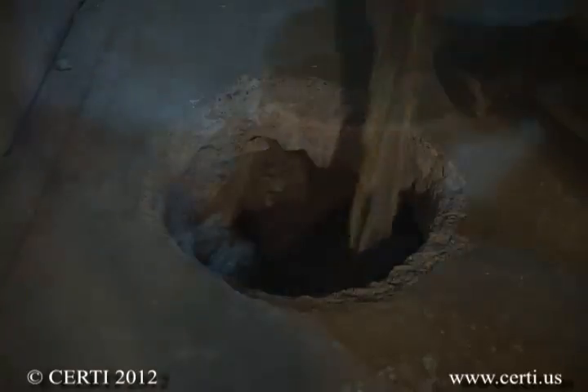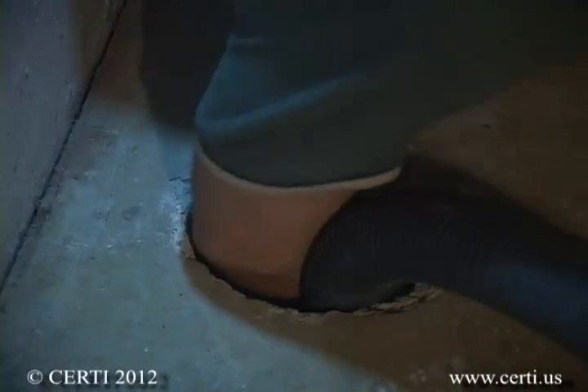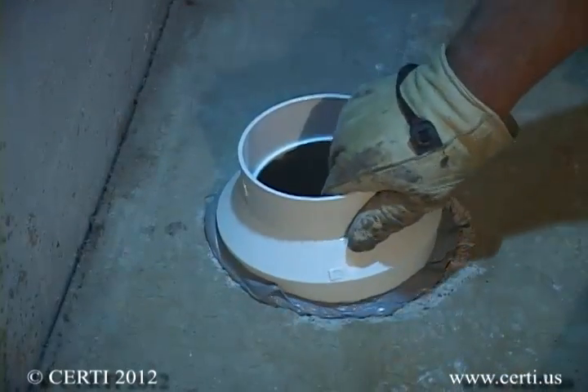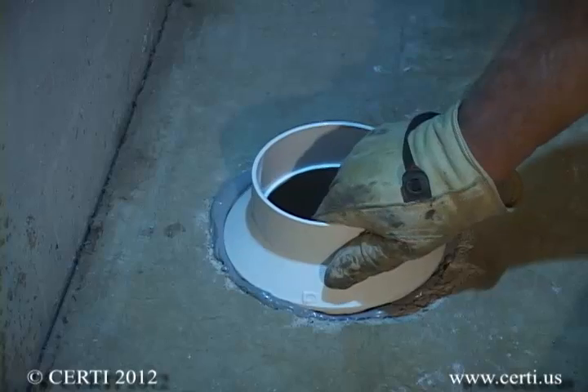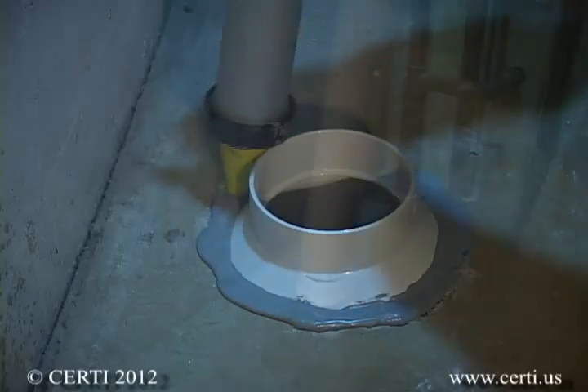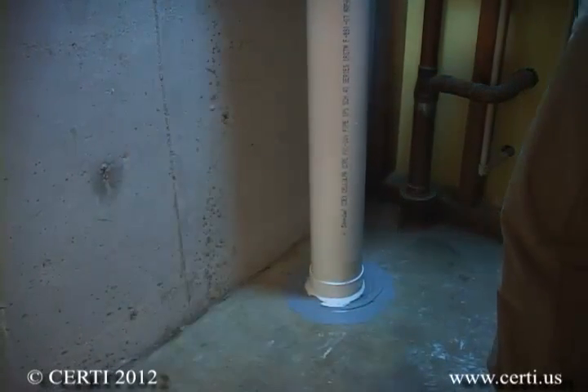It is very important that you dig out a pit beneath your hole, removing at least 10 gallons of soil. Also, the tighter the soil is, the more dirt you should dig out. Install the bushing by applying caulk to it and twist it into the hole. Apply additional caulk between the edge of the fitting and the floor to assure a good seal. After the suction point is complete, simply glue your vent riser to it and route it to your fan.